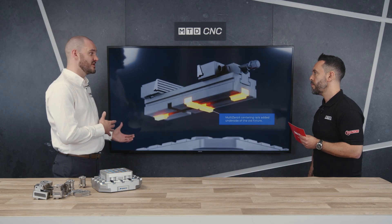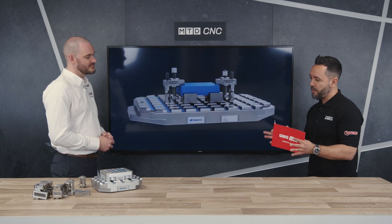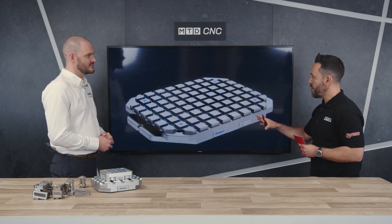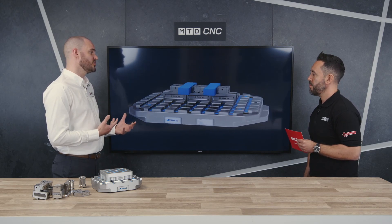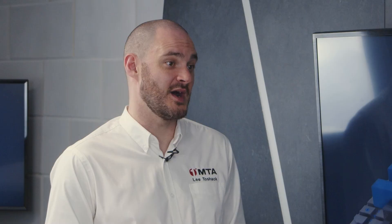So you can go from your machining centre into your wire EDM machine and then onto a CMM. If anything's wrong, the part can be replaced on any of the previous operations within five microns of where it was. In the EDM industry there's a lot of aerospace work, so traceability is important. Each pallet can be barcoded — you can trace the pallet to the shift, or even to a specific operator. Each operator has their pallet, does their work in shift, removes it at the end, and the next person puts theirs on. When you return the next day, you put your pallet back on and resume exactly where you were.